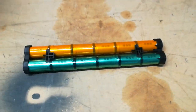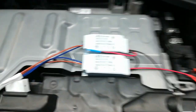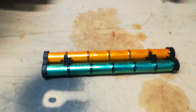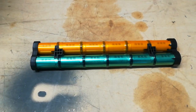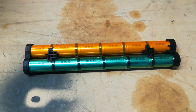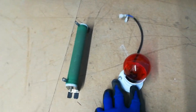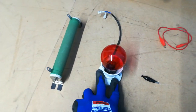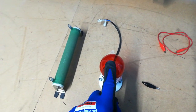Simple grid charging using the LED power supplies may well do the job. But if your pack is in the last chance saloon and simple charging hasn't helped much, you can try cycling it — charging then discharging. To cycle it you need a charger and a discharger. The discharger can be something as simple as a light bulb or a resistor connected with crocodile clips. I prefer the bulb because it gives a visual indication of when it's connected and doing something.